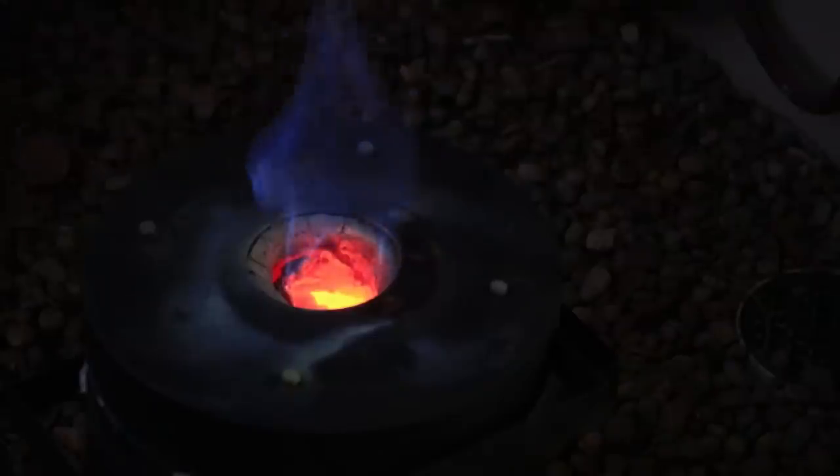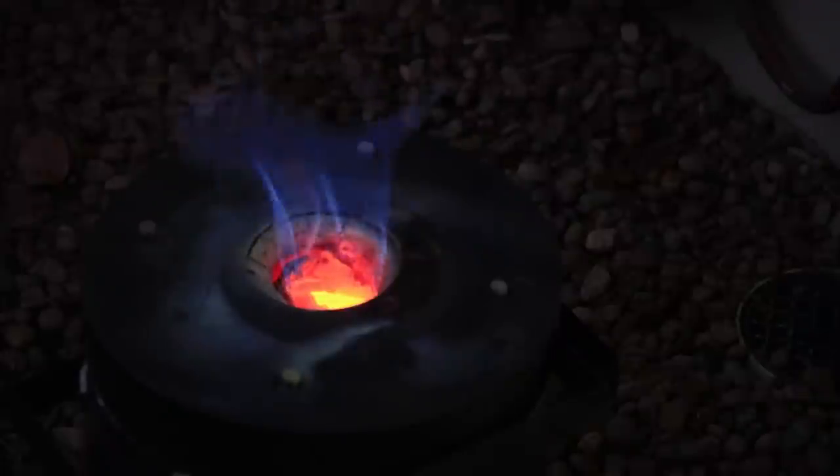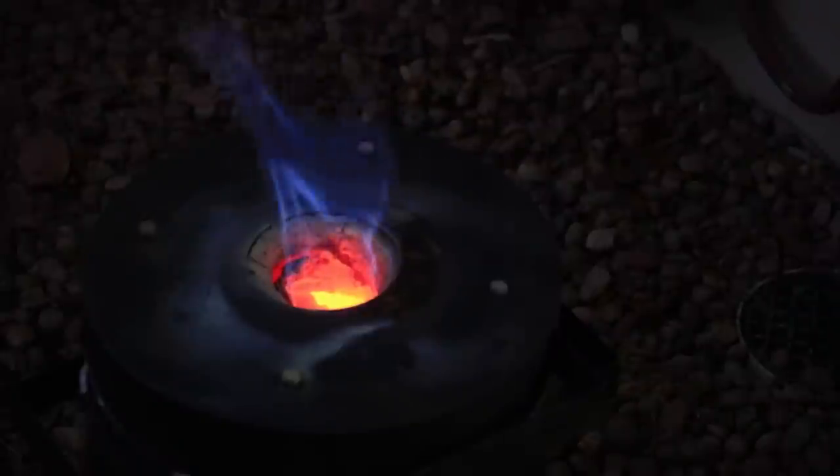Because my forge is relatively small and I don't think it was getting all that hot, and because I also wanted a relatively thick case, I let it harden for about eight hours after it reached that high temperature. And if I'm lucky, that will give me a case which is about two and a bit millimeters thick.